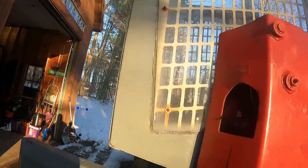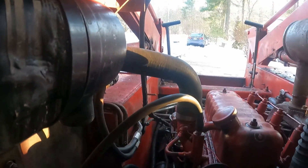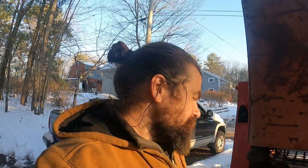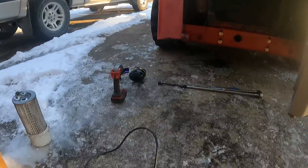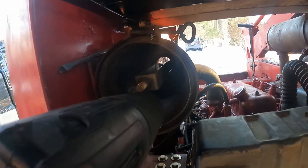We've talked in previous episodes about the strange sort of spark plug-like thing with that little red wire coming off the intake that starts a small fire in the intake with diesel to help you get it started in the cold. And what I've been doing to start lately is just taking this lovely heat gun, putting it right into the air box and turning it on.